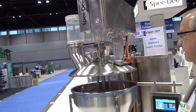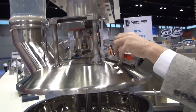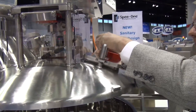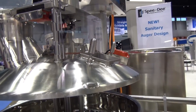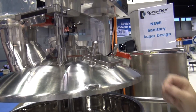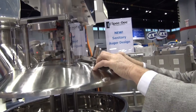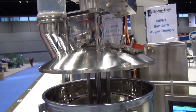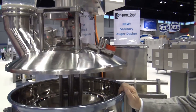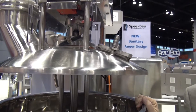Some of the other things we've done here — again from a sanitary point of view — your hopper access panel is also guarded so any fluids would flow away, and it's electrically integrated so if you remove it the machine won't run. Inside the hopper, we've removed all fasteners so there are no fasteners in the product contact area.